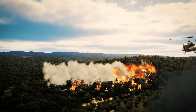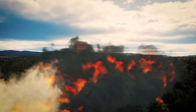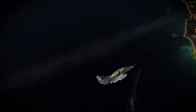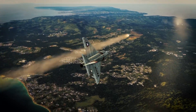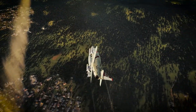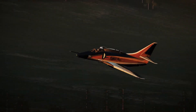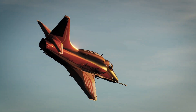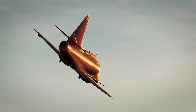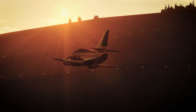The Skyhawk was powered by a single engine — first the Wright J65 turbojet, and from the A4E onwards the Pratt & Whitney J52 engine. Two intakes on fuselage sides fed the engine with air. To save weight, the entire aft section of the aircraft could be removed, allowing ground crew access to the engine for maintenance. This alone saved 200 pounds of weight. The Skyhawk had a tricycle undercarriage, and here too weight was reduced. The main wing-mounted landing gear did not fully retract into the wing; instead, only the wheels disappeared in the wing, while the undercarriage struts were housed in fairings below the wing.